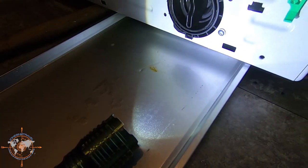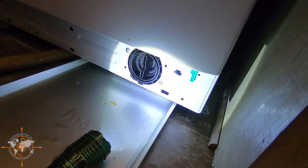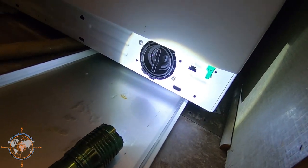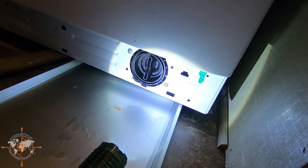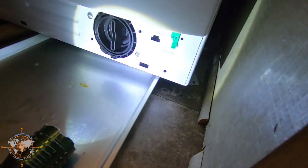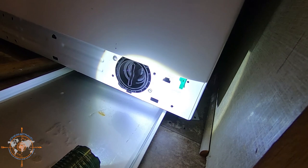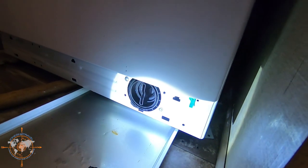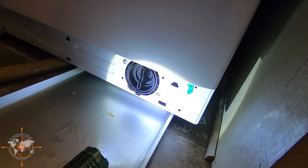I'm going to put this cap back on — the pump impeller is spinning fine. It just screws in like this. So I've got some homework for you guys: if you own a washer-dryer like this in your RV, take the time before your next load and take that cap out, make sure there's nothing in there, because it's a real mess. I probably took three gallons of water out of this thing. I'm going to slide it back in and bolt it back to the floor. The cool thing is I didn't have to take the toilet out.